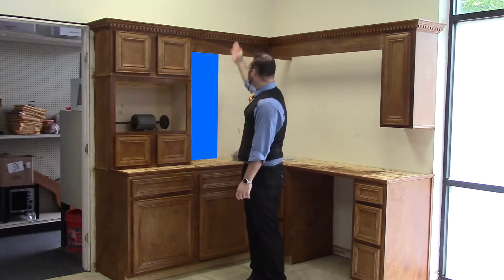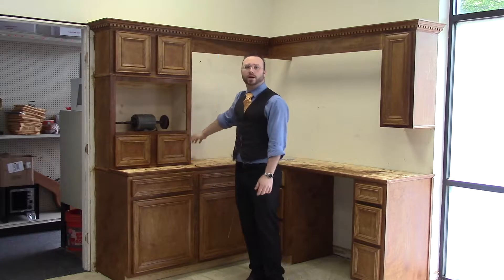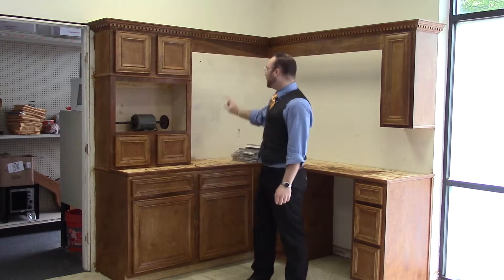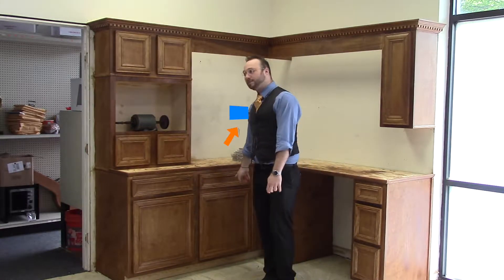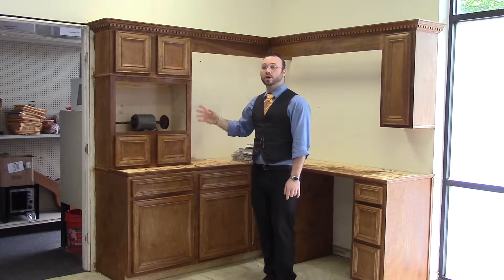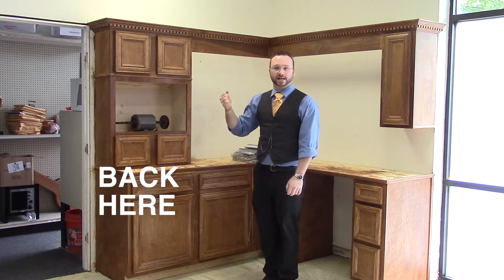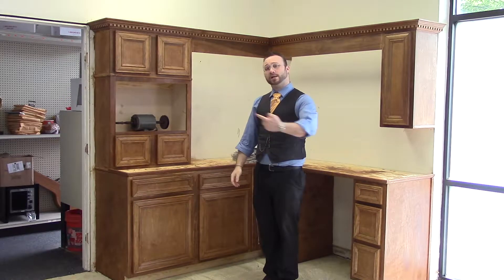We can't quite tell, and it's been incredibly irritating. So instead of worrying about where my tile is and whether or not I'm going to be able to get it, I'm going to focus on doing something productive and skip straight ahead to installing the electrics. This area is about where we're going to put in a control panel for everything. We'll be cutting out the wall and putting in a bank of switches. Basically everything needs its own switch — the lights, the polisher, the ultrasonic, the heat for the ultrasonic, and so on. I want to make sure everything is run to its own breaker in the back panel so we'll have a dedicated work area breaker from now on.